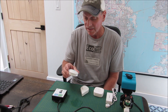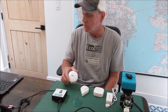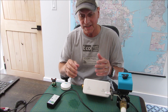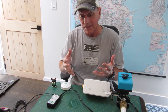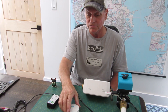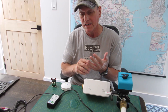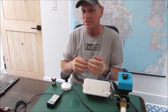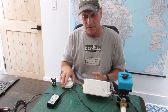That brings me to another best practice point: it's a good idea to put a label on them that says 'Leak Sensor — Do Not Move,' because inevitably somebody will move it, and this would discourage them. Also in terms of best practices, we recommend that when you first install your system with leak sensors and a shutoff or some type of flow sensor, you test the leak sensors with a wet paper towel in position wherever they are — in the laundry room or the bathroom — to check for distance issues. You test it when you first install it, then again three to six months later, and after that once or twice a year. Lots of things can go wrong: your router could change position, or there could be new electrical interference in the home. Regular testing also gives you a chance to check battery life.